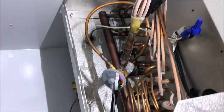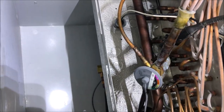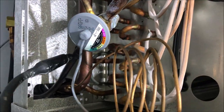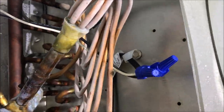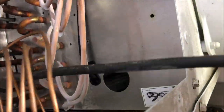I'm not getting any indication of a leak on the condensing unit. Pressure is kind of low on the suction side. Moving to the coil now - distributor, TXV - hitting up all the joints the installer has sweated in. I've hit fast forward here, but I'm really taking my time being thorough, hitting all these u-bends. These evaporator coils love to leak even at only two to two-and-a-half years old.